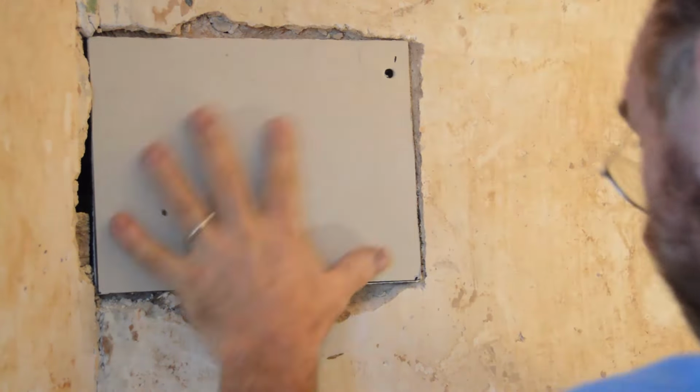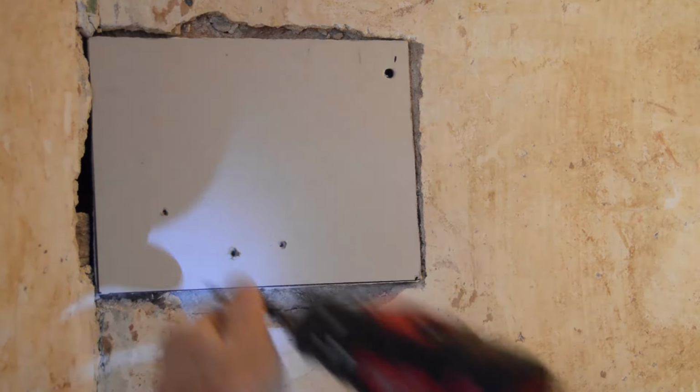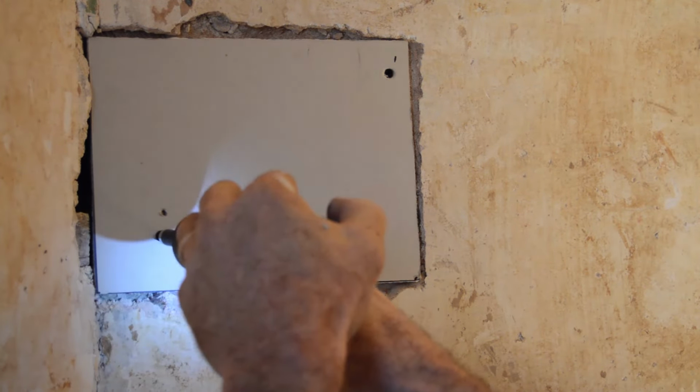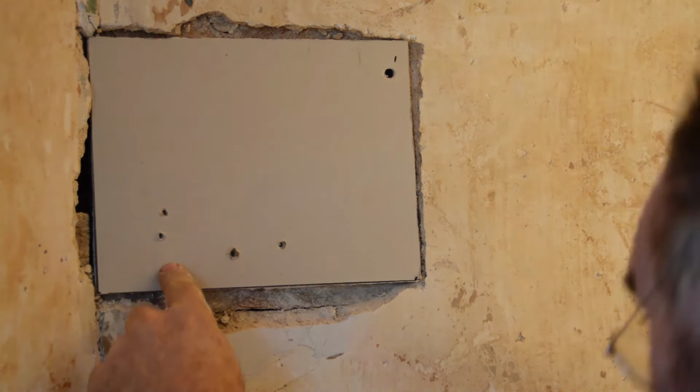will fill that in. On the left side, I'm going to look for a piece of lath, and I'm going to miss it on the first try, but I'm going to get it on the second. Again, we're just putting this patch in place. The plaster itself is going to make this firm and strong, not the sheetrock screws.